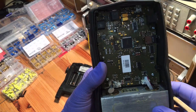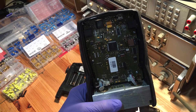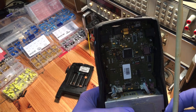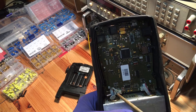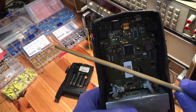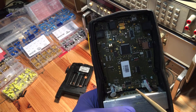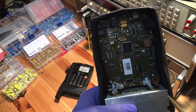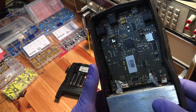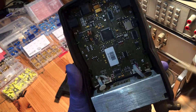But there was one other thing. I made a mistake a while back — a damaged regulator. My nitrogen tank fell over, it hit the high side gauge and made it so the needle would not show the true pressure. One time I had over around a thousand psi but the needle only showed like 600 psi, and I was doing a nitrogen pressure test on a unit that required 650 psi. But it was actually at a thousand.